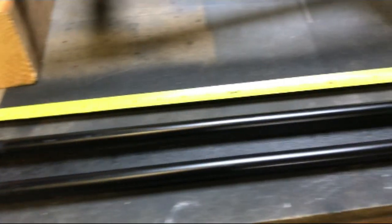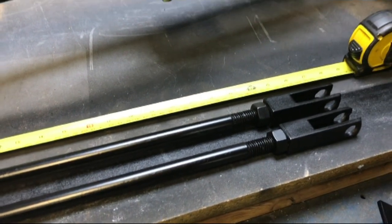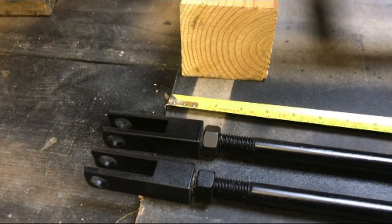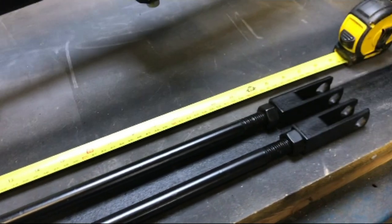The next job is to put together the push rods. We've got all the components together with the clevis forks and the nuts, but what we now need to do is adjust them so that it's 26 and a half inches from the center of these holes to the center of these holes. Once we've done that, we'll be able to put it all on the tractor, plus a few pins. We have the push rods adjusted to the right length now.